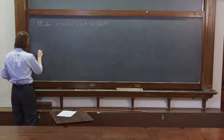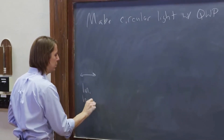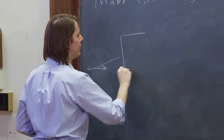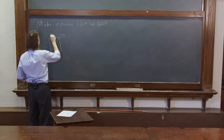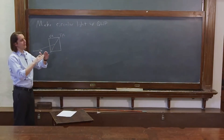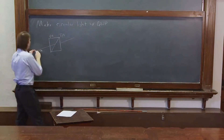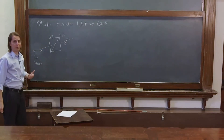We'll start with horizontally polarized light — so this is linear and horizontal. I'm drawing the light there and we're going to send it along the optic axis. The first thing it needs to hit is a polarizer, because the polarizer is going to be set at 45 degrees. The reason you want to do that is you need to have the light polarized at 45 degrees to the wave plate, because you want to get some polarization along each axis.